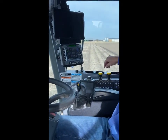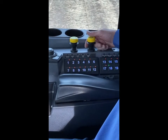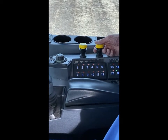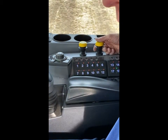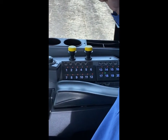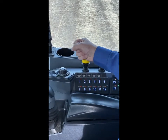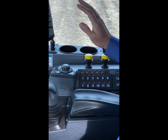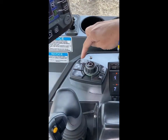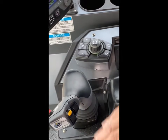On the dash control itself, you have two main functions. The machine is hydraulically driven with no electric clutches, so you don't have to worry about speed or turning things on or off at high or low speeds. One button basically runs everything from the rotor back — you just push and pull up. If you need to shut it down quickly, just do a quick pop. The second controller handles the header control.